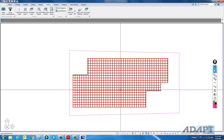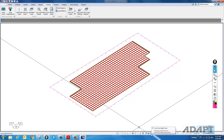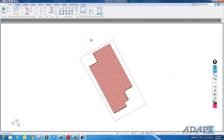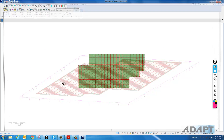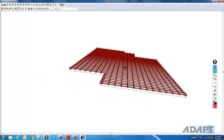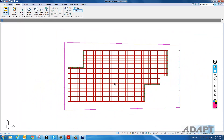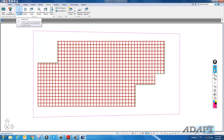We're going to now jump over to loading. We have all our tendons in the slab. We'll add some loading — just a uniform load. There are several load types: point loads, line loads, patch loads, and wizards. We can add loads by mapping to a selected slab edge. I'll select the slab edge and add a patch load: live load is 0.04. Then for my line load, there's 500 pounds per foot dead load on the perimeter.